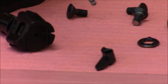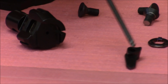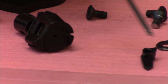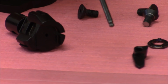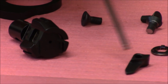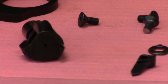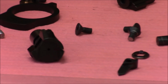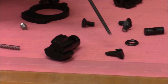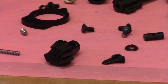But yeah, the Springfield type ejector is better, in my mind, than that of the Mauser, because the Mauser actually required a spring to drive it into engagement with the case head, whereas this is driven by the inertia of the bolt, which is a tremendous forcing function. So that's very, very good, and they're super robust, right? It's a little hardened steel part. There's nothing on it that can break.